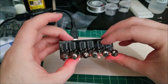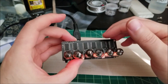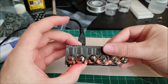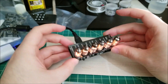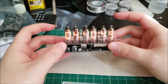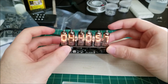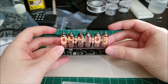The tubes are being driven. There's a diode between them just to drop the voltage a bit since they're rated at around 4 volts — they are self-current regulating. The chips, which are just 595 shift registers, do get a little warm at full brightness but nothing hot, so I think they're fine. I probably could have added a little resistance to not drive the tubes quite so hot, but nothing gets warmer than my finger, so it should be fine long-term.